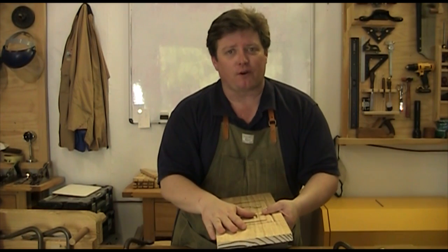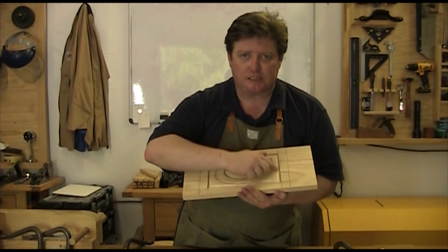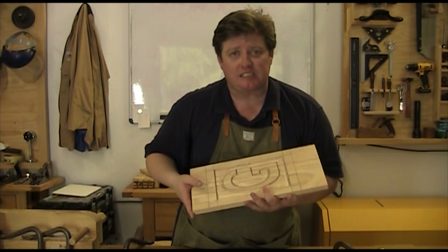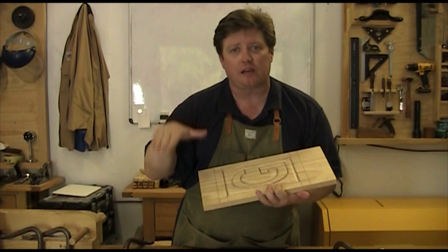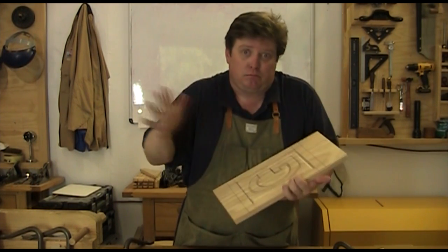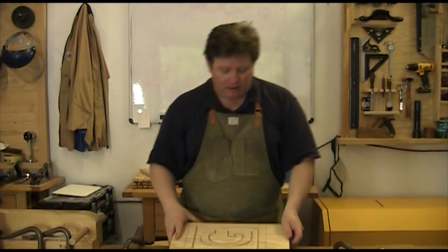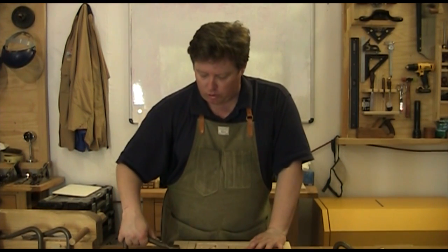So, for the next few minutes, I want you to start clearing out as much of the waste as possible going across the grain. And you've got to look at your board and decide which way you're going to be laying those fibers down and which way you're going to lift them up and cause a split. And if you do start getting a split, hey, stop. Pull the chisel out, come in the other direction. Now I'm going to reclamp this one down. I do suggest you have it clamped down, and this would be a good time to use your mallet.